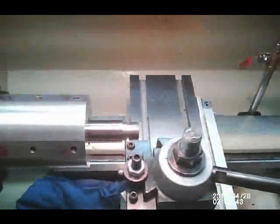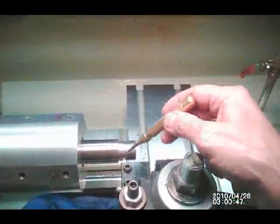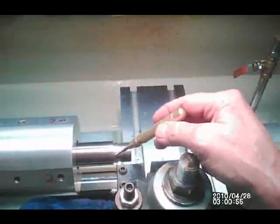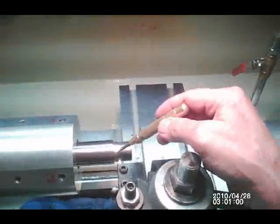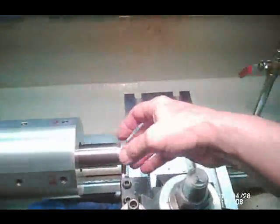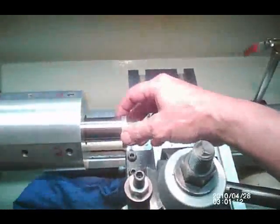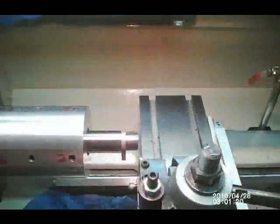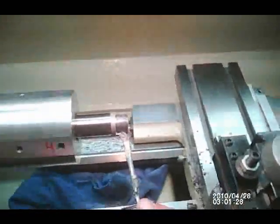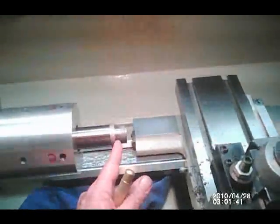We've finished our 16 threads per inch. The thread cutting tool insert is right in the center of the relief cut — it has just barely scratched the bottom and hasn't interfered with the shoulder on the flat area left for the recoil lug. Now we'll fit the recoil lug. We're going to put a little anti-seize on the threads, because the last thing you want is to thread on a stainless steel barrel without anti-seize. Only put a little bit on the end — do not cover the whole thing and do not use an excessive amount, as it will travel through the threads and be pushed up against the recoil lug.